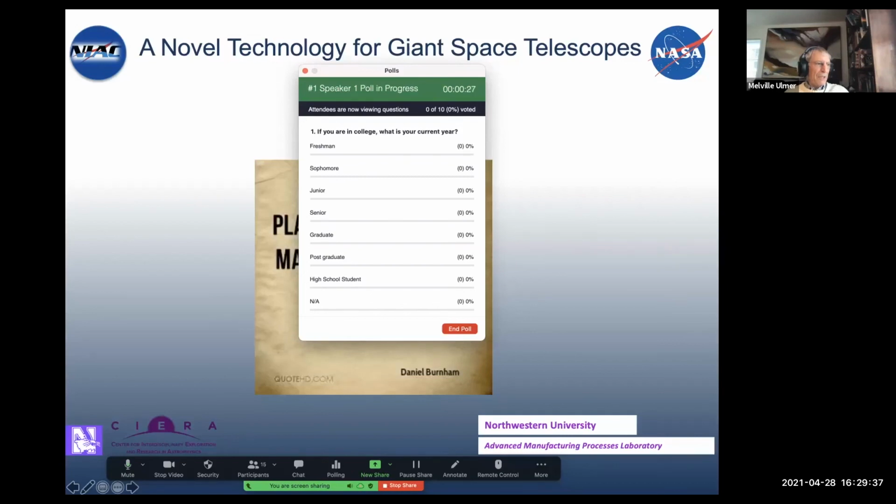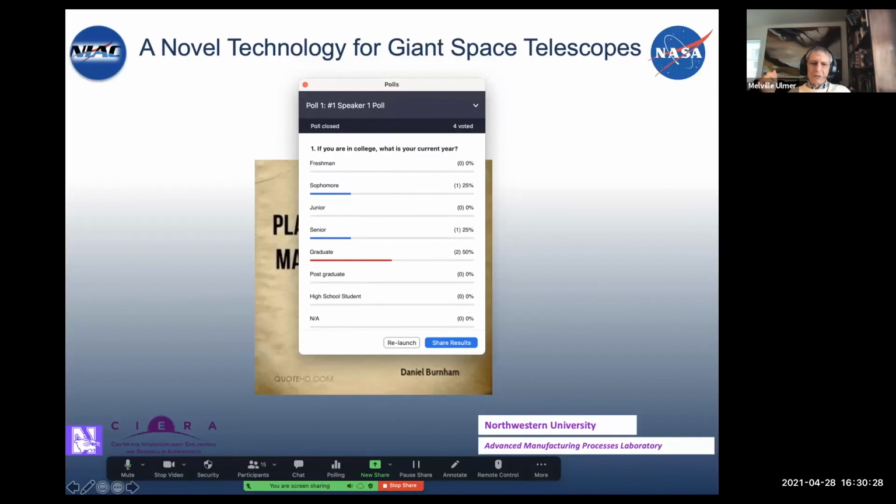Yes and no. I claim that the magnetostriction is more universal, if you will, because we can put it on membranes and it's not going to print through, whereas piezo patches do print through. The piezo patches have been used quite effectively for what they call deformable mirrors for exoplanet imaging. Those mirrors are only about 5 centimeters in diameter, and the requirements are quite a bit different, and those substrates tend to be stiffer and more robust, so you don't have the print through. Okay, thank you.